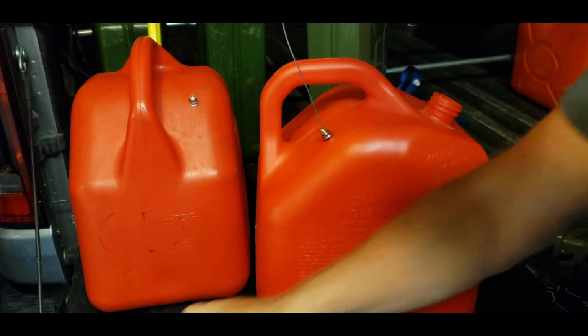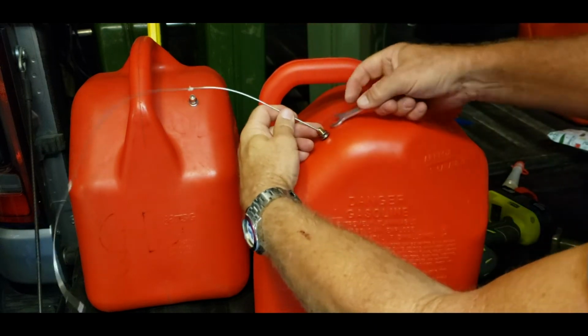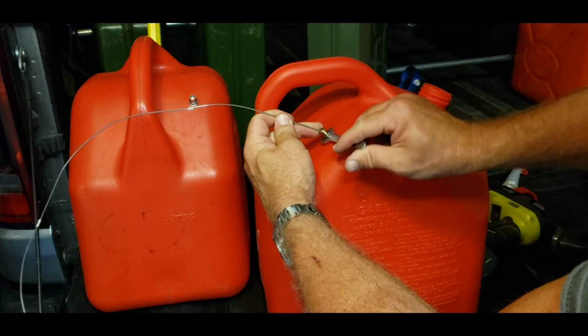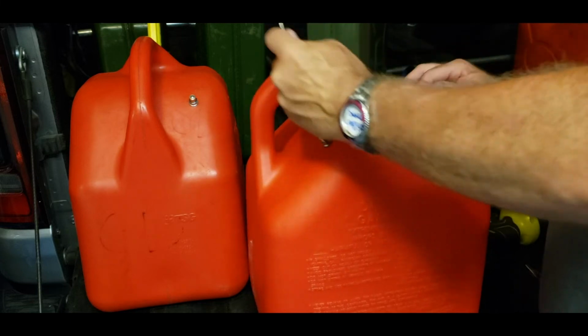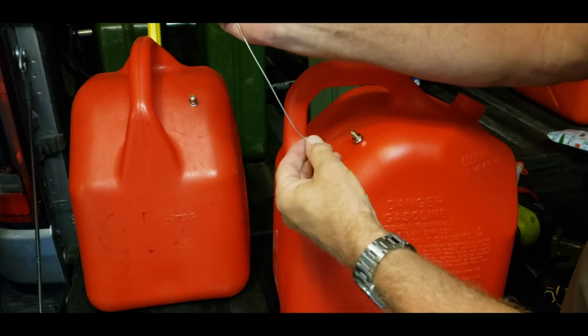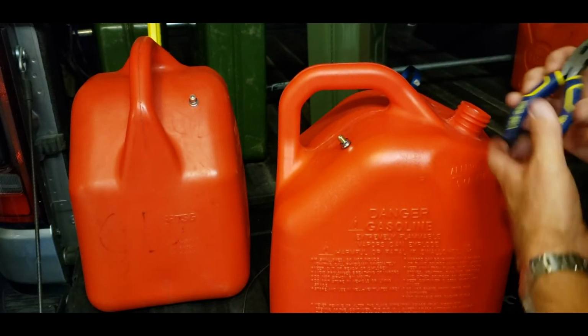Once the wrench starts to turn it where the entire vent starts to spin, I'll take the wire out and use a pair of needle nose pliers to gently grasp the vent without damaging the threading and hold it in place while I tighten the nut as best I can. Get a really good tight seal that way.